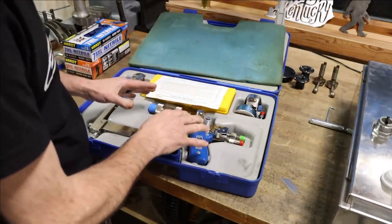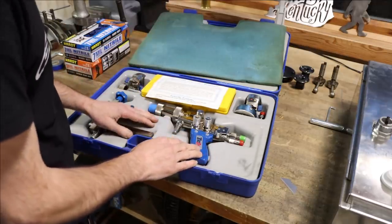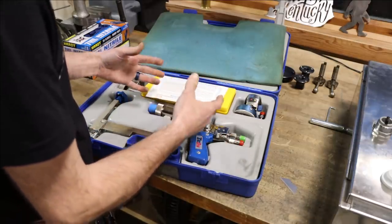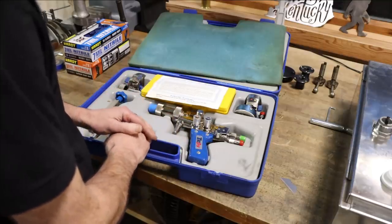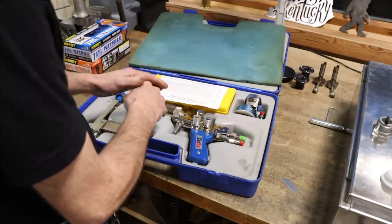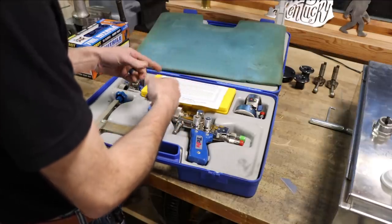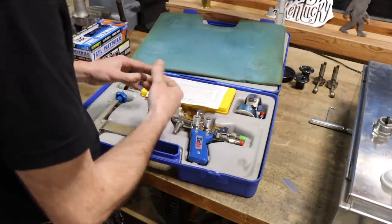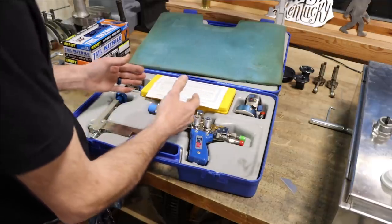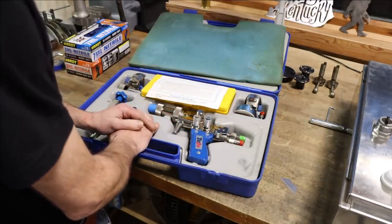Now, this model of spray welder has been around for almost 40 years, I believe. I talked to Dave over at Eutectic, and we just discussed the use of this thing, some of the applications where these things are really suited: building up boiler walls where they've corroded away, building up crankshafts, not on the throws of a crank, but on the main bearing journals, motor parts in general, building up bearing journals on shafts that are worn.